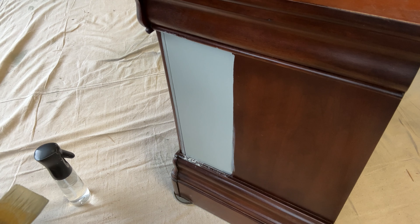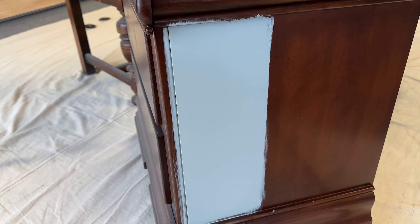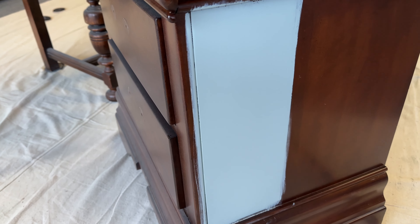With just a tiny bit of water and a light hand with my brush, you will see when this dries down there will not be a single brushstroke visible. That came out so incredibly beautiful — not a brushstroke to be found. Getting in really close at different angles: it came out so smooth that you would not know if I brushed it or sprayed it. In conclusion, that's all you need: water, a good paintbrush, and a sanding pad. Making those three additions to your process will help you achieve that beautiful, flawless, brushstroke-free finish.